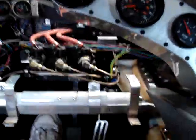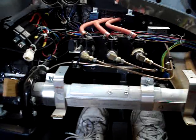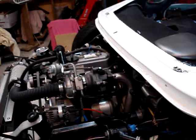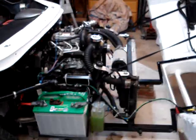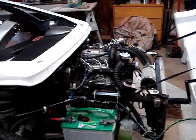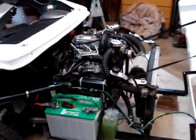As I mentioned, I was having some engine problems — happy to report the engine problems are taken care of. Let me just start it up real quick and show you. I do have a clutch lockout, so you have to have your foot on the clutch to start it up. I had trouble running the engine above idle — it wouldn't accelerate. But I ran some diesel fuel cleaner through the engine and managed to clear up that problem. It's probably my fault for letting the engine sit for seven or eight years without doing anything to it, but it is running well, it is accelerating as it should, and it's making good power.